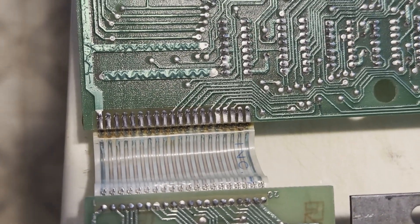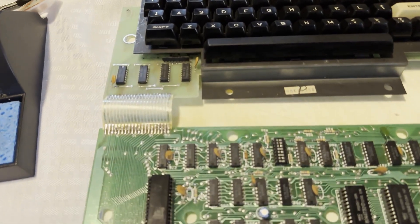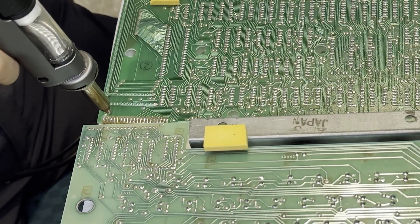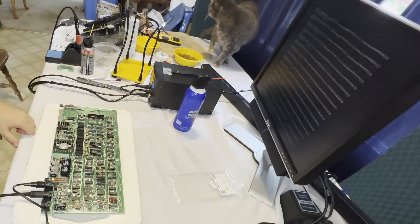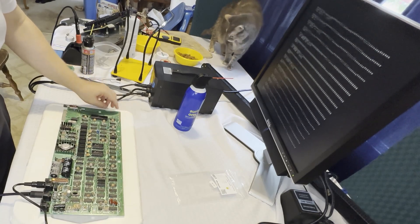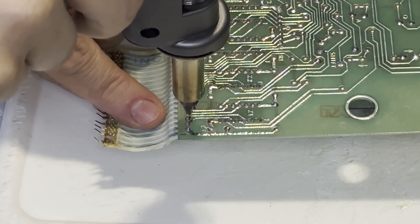Now that looks a lot cleaner, but take a look at this screen now. It's a little more stable now, but now I think we've got some stuck keys. Oh, these bloody plastic ribbon cables. That was the same result I got when I pressed random things on the memsize prompt. Off comes that ribbon cable. It turns out you need the keyboard attached or the computer will be stuck in this loop on startup.